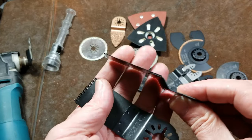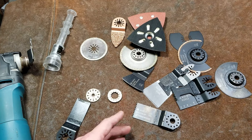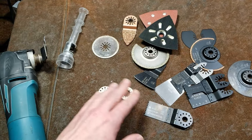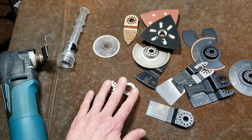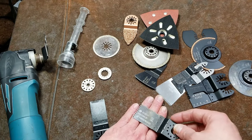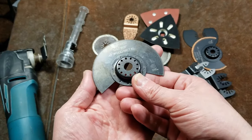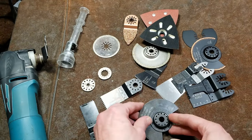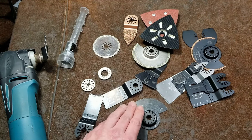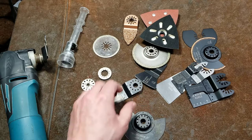These are offset. Many blades are like that. So, for instance, if you're replacing linoleum with some tile, things like door trim will actually be hanging too low. Instead of dealing with trying to cut it using hand saws, you can tear up your old linoleum flooring, make sure the surface is clean, put a piece of the tile down, and you run one of these blades — or even one of these big circular blades — over the top of it. These allow you to cut in any direction, go right along the top of the piece of tile, and trim that door trim that's hanging down to the exact level. The gap will be just super tiny, like a sixteenth of an inch — and so that's one of the many uses.